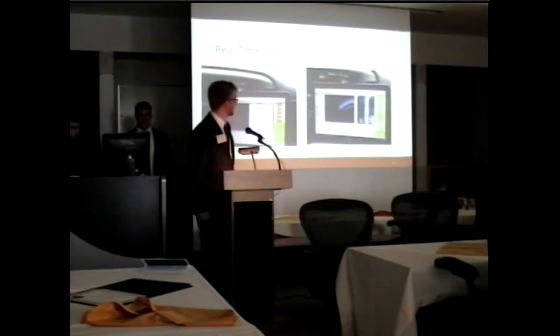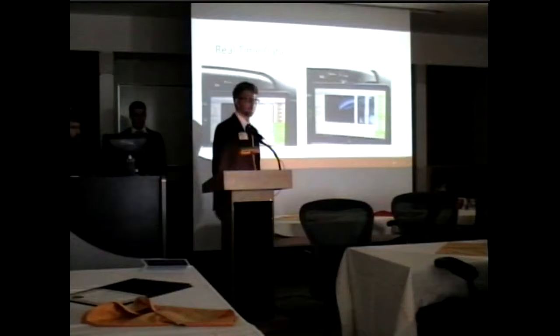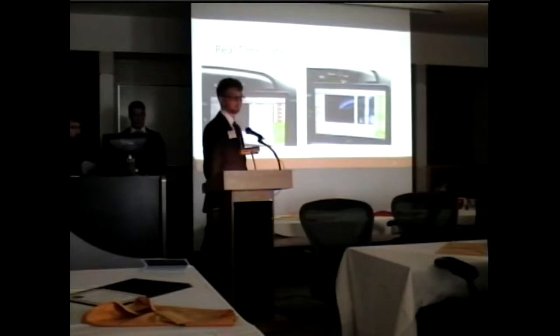The image on the right is actually showing real-time data being taken. There's a bunch of little hexagons there. Those are the actual instantaneous locations where the Ladybug camera is taking the pictures. You can set that to either a specified time or distance traveled to take your pictures. For this project, we used 30 feet because that's what Fishbeck uses in their normal projects. It's kind of hard to see, but there are blue lines on the outside, which show the limits of the scanner's region.